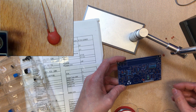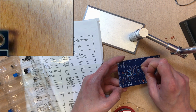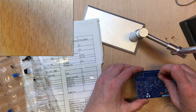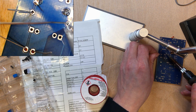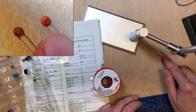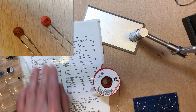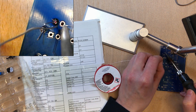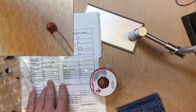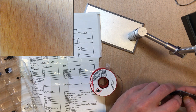Ceramic cap positions: C23, C3, C24, and C66. Code 102 is one nanofarad — that's C5 and C22. Code 271 is 270 picofarad — C21. I think that's the last of the ceramic caps. There are also a couple of resistors I kept missing earlier.